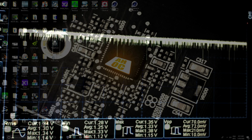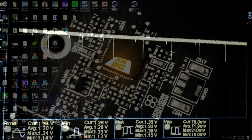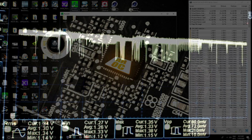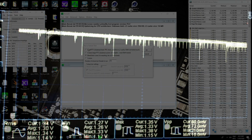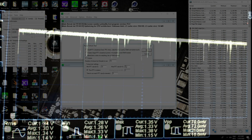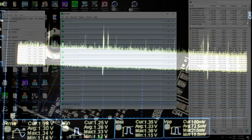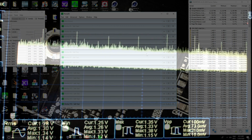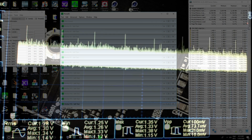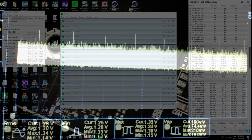So we can't really do anything about the spike, because it's just tied to the scenario and the physical capabilities of the voltage regulator. But now we're going to run 32K, but with the medium LLC. And you'll notice our voltage, instead of going up, has gone down. Previously, at idle, our voltage would go down because there's impedance between my measurement point and the actual silicon of the CPU.